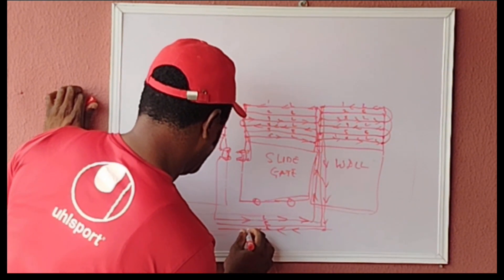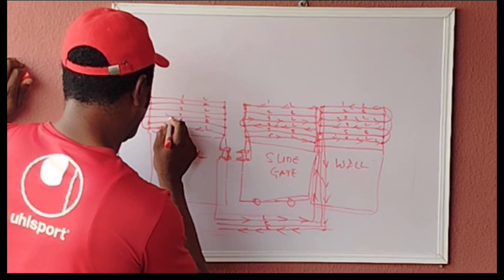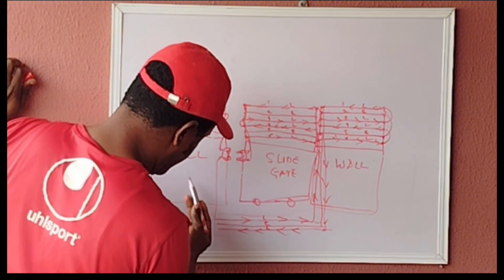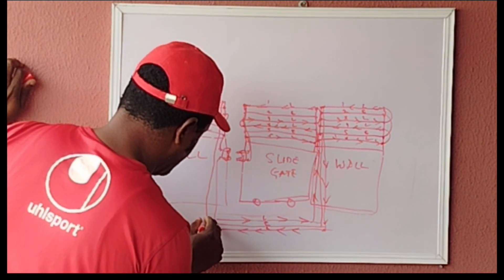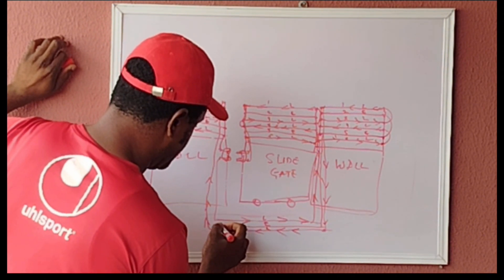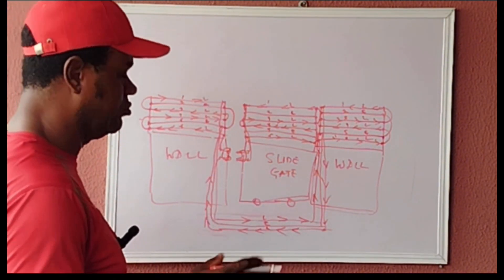Now from this point, use HT cable - take this one down to the next live which is this one. Then take your earth through the same pipe and it comes here and hits number five. Now it means this cable came in from here going this way: it entered number six, number six to number four, four to three, three to one, and one is returning. So this is the return. Since this one is already ready here: it's flowing this way, gets here number six live, to four, four gets here to three, three gets here to one. When this one gets here, through the same channel pipe inside this wall, come out with your HT cable and take this to the live. Now the only thing left is the earth - take your earth through that same pipe, come to your number five, hit your number five, and number five continuing can be in parallel.